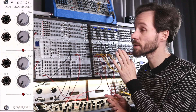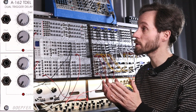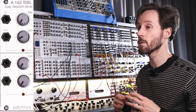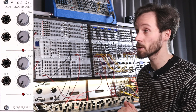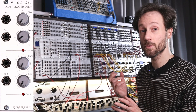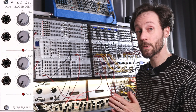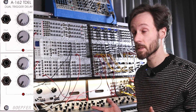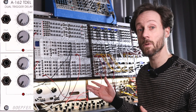With the analog trigger sequencer from Doepfer, when you don't have the sequencer controller, you only get three triggers and one gate with two rows of CVs. So if you want more gate signals, if you combine it with the dual trigger delay, you can actually turn two of those trigger sequences into gates. This dual trigger delay is a really simple module, but if you have a big modular system and work with trigger sequencers, I think it's a must-have.